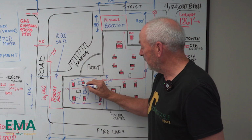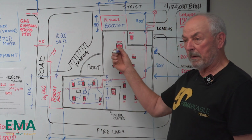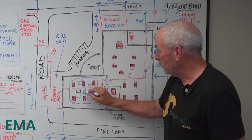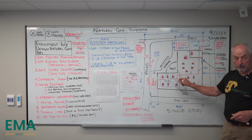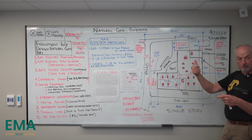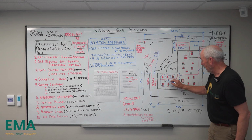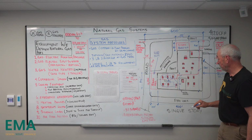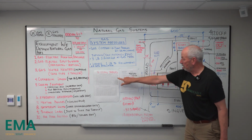And you've got to look at and see where the gas tie-in is on the rooftop. And you can determine that on the family, the rooftop family. And so the gas regulator has to be no closer than 10 foot to the outside air intake on the rooftop, because they burp gas. You know, they just burp gas. That's how they work. So we got to make sure that wherever the intakes are on these rooftops, we're maintaining 10 foot from that.